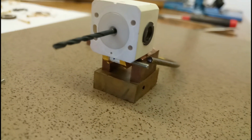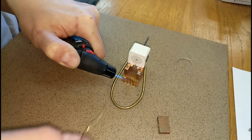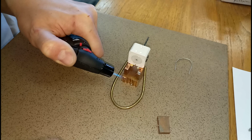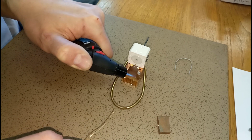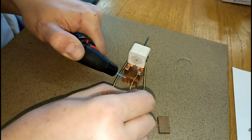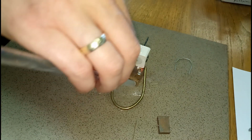The stator is a glass-like material, and as such it is very sensitive to temperature gradients, so I used a makeshift soldering stand from copper to transfer heat to the contact tabs. I was checking with a small piece of solder on the contact tab when the solder melts. Another indication is the color oxidation of copper, which begins at around 300 C, the same as the solder melting point. Cooling was done again through the copper tabs.